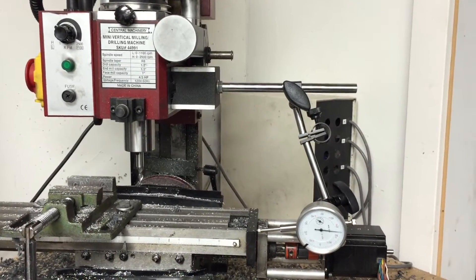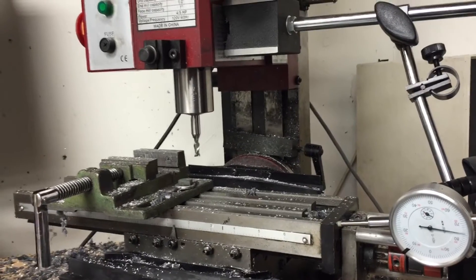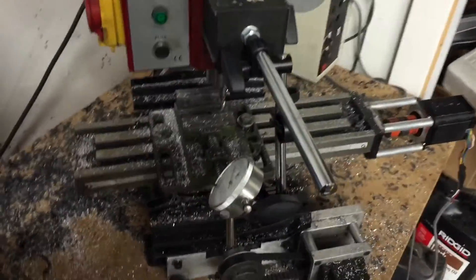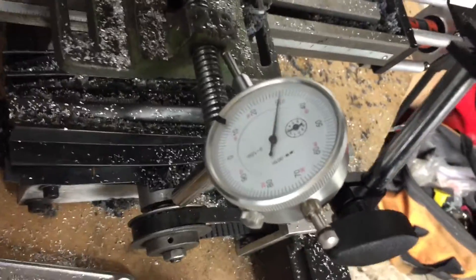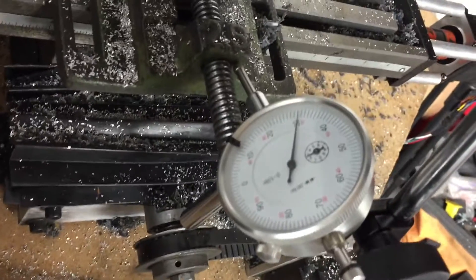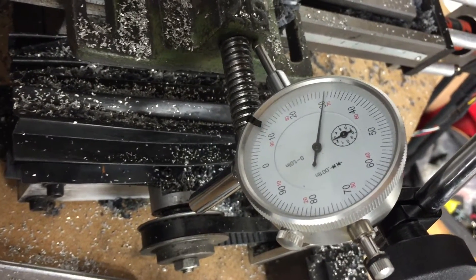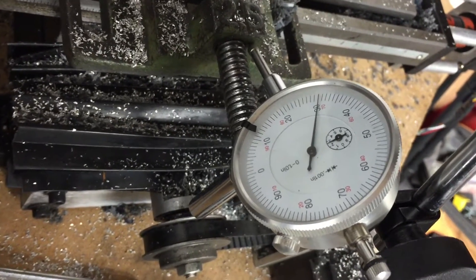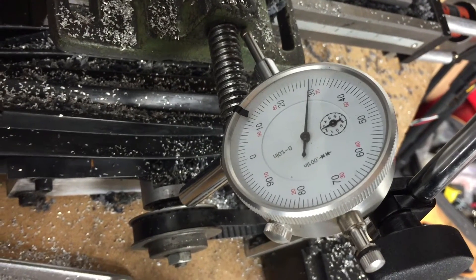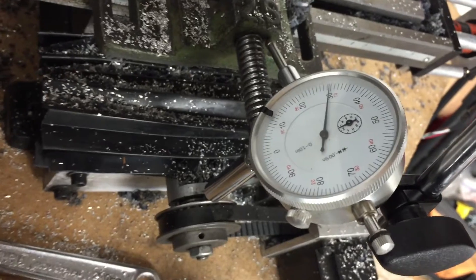Now what I should do is test the Y again and just make sure that I'm right on the money. I'm going to stop this and reset my indicator. It's a magnetic one — a cheap one that came with some tools I bought. It has a cheap dial but for what I'm doing it's doing the trick. Now we're set up to check the Y, going off a somewhat flat surface on that vice. I got it set on the 30 mark — set for 20 thousandths. Each click will be one thousandth movement. We got a half thousandth there, so I need to increase it by 1.5 thousandths.